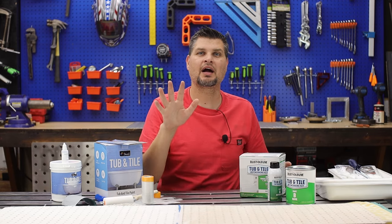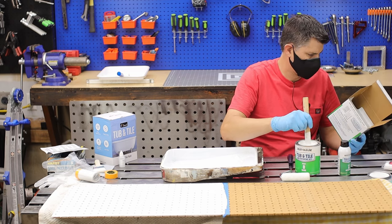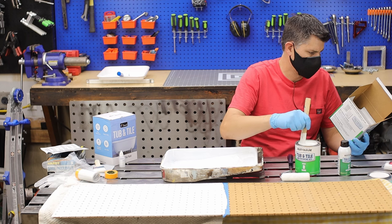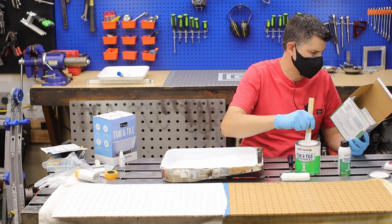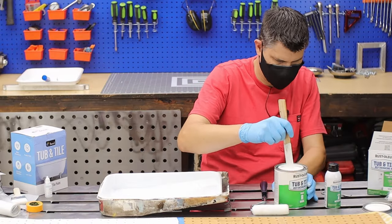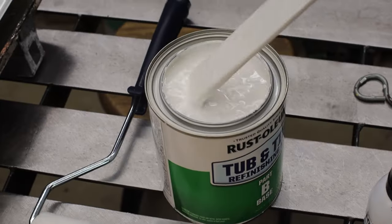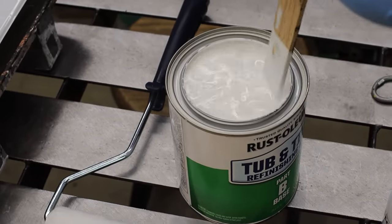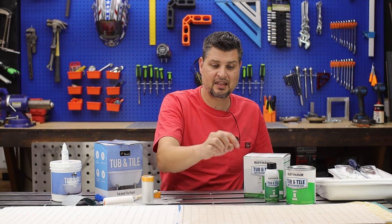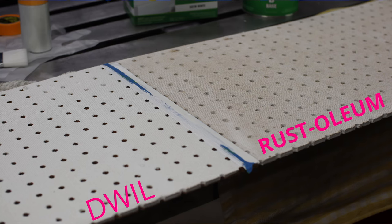The two main reasons why I would suggest — and did — the rest of my shower with the Dwill: the Rustoleum was super thin, almost running-water thin. I checked the ratios and read the instructions numerous times and did it correctly, and it really was super thin — so much so that this side with the Rustoleum had three coats of paint versus the Dwill only had two.